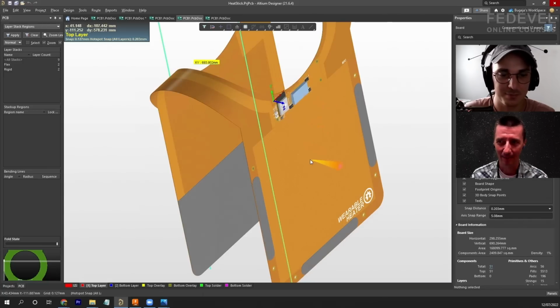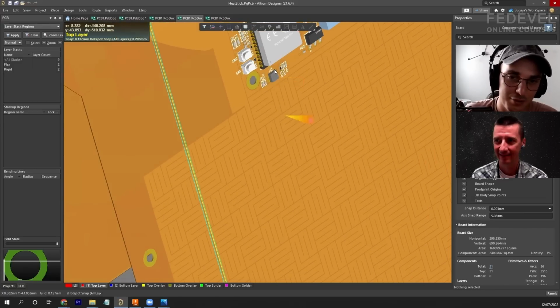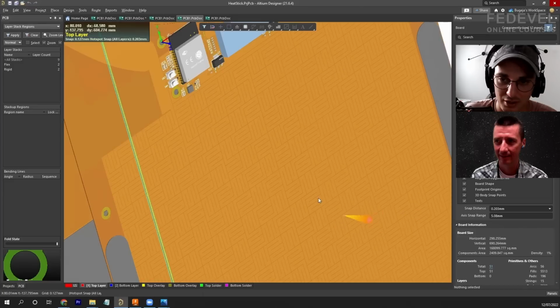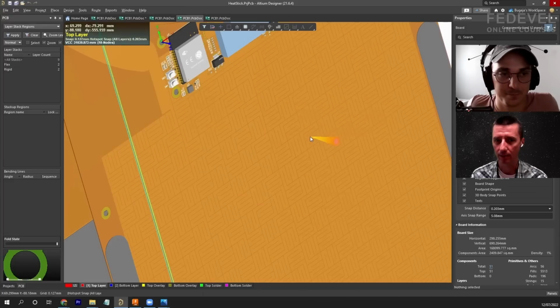So there is a sensor somewhere? Yes, there's a small sensor over here. There was a little temperature difference between the maximum temperature heating point and this area over here, but you can compensate for it in software if you like. How do you know? You use a thermal camera to find out what was the hottest? Yes, I have a thermal camera.